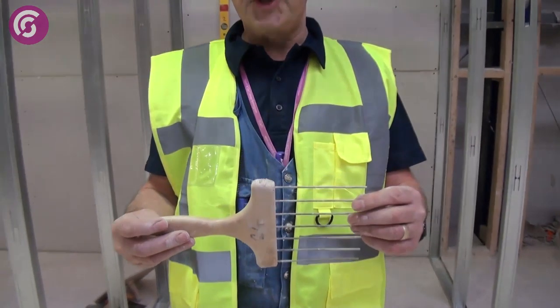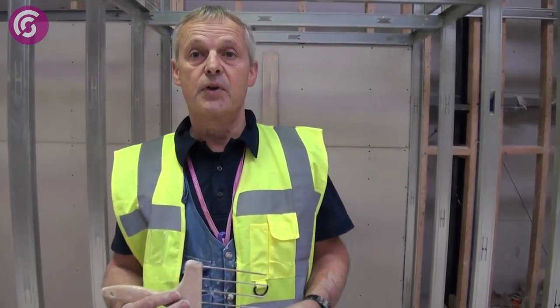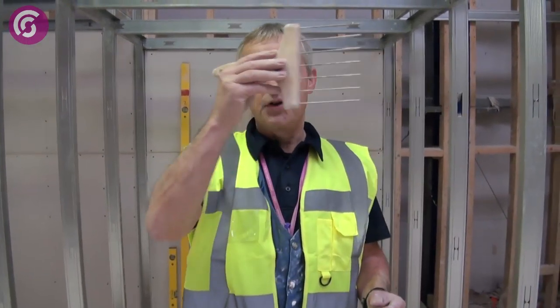This tool is called a wire scratcher. When you apply your first coat of rendering — called the scratch coat — you do wavy lines across the rendering. This provides a mechanical key for your second coat of rendering.